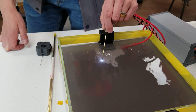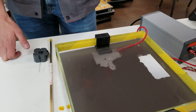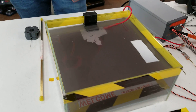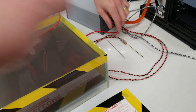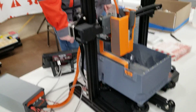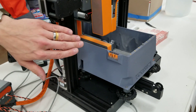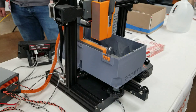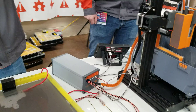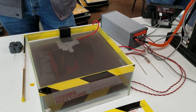What's the thickest material you've cut with this? Aluminum wise, your limitation when you go to cut material is how long a span of wire you can get. On the wire tool, we're constantly refreshing the wire. The physical limitation comes from the effective wire span for cutting. Right now that's 32 millimeters on this tool, and on the machine John built, that's around 60 millimeters. There's no physics limitation for how long a span you can have — some people have wire EDM machines up to like a meter in length.